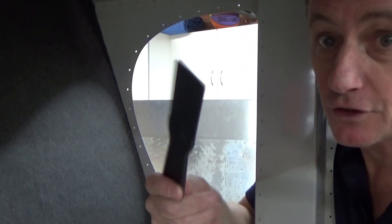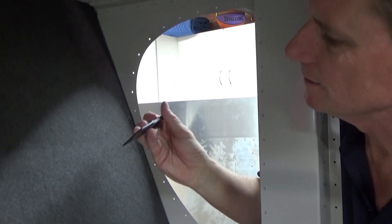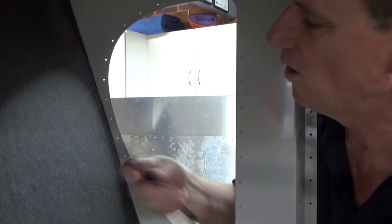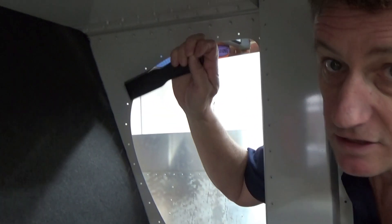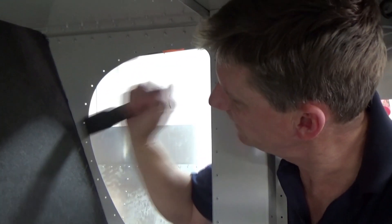With the spatula or a sharp edge — without taking the paint off the fuselage — you just bounce it along and tuck the edge in, and that's turned out fantastic. Really happy with that. Perfect edge, all tucked in nicely. So the way I'm doing the carpet: first I use masking tape to get it where I want it, fold it back. Tape half of it, lay some more tape, and then it just goes boom, right into position.